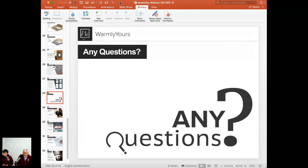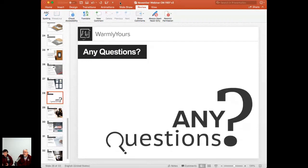Heather asked that. So really any flooring material, or maybe I should say flooring manufacturer, that specifically prohibits radiant heat of any kind, that's where you need to comply with the flooring manufacturer's instructions. But as far as we know, really any flooring can be heated as long as it's approved and designed to be used with radiant heat. And it doesn't have a high R value. No high R value, no extreme thicknesses where the heating system just physically cannot transfer all that heat to the top surface.